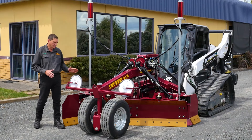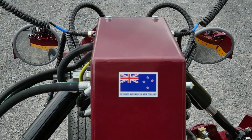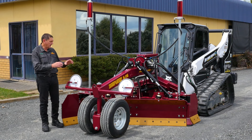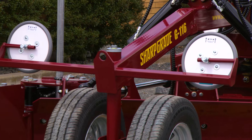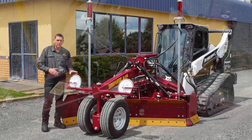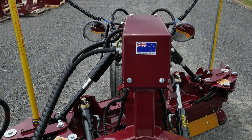Some of the features on it are twin parabolic mirrors, and these are mounted outboard. These allow you to see the wing and the blade in any position — when it's fully back or fully forward. Because we don't have an A-frame and a circle drive, our gooseneck can be a lot narrower, which gives you better visibility. The operator can see both mirrors outside of the cylinders, giving an unimpeded view of the blade.